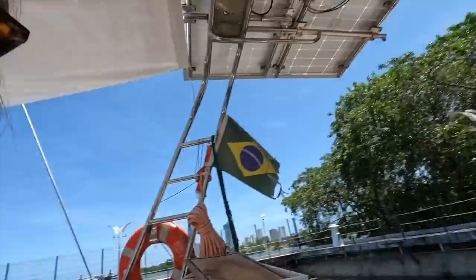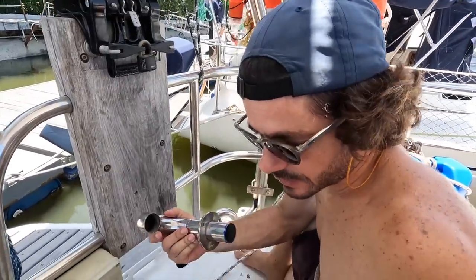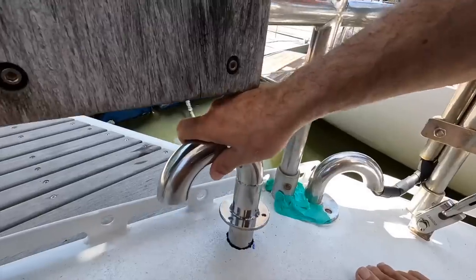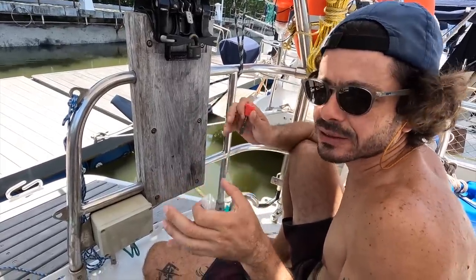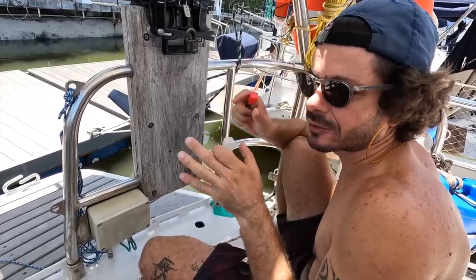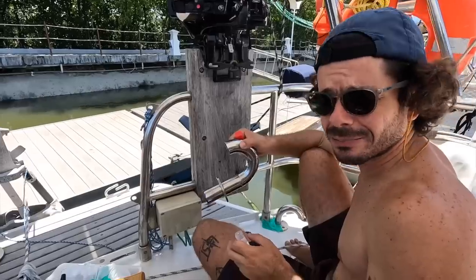After two hours — as you can tell, the hole is not clean. The reason is I don't have the proper size drill bit for this big pipe. With what I have I'm going to make a better surface and I want a little slack because I want to properly paint — when there's no slack it'll crack the paint later. It doesn't need to be a pretty hole because it'll be covered anyway. It's gonna be good.